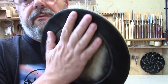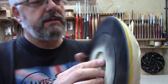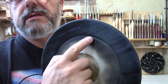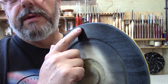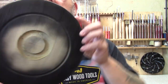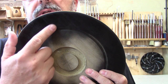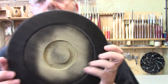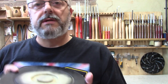Very often when you're painting you can get a bit carried away and get paint on the other side, so you might need to rework that side of the bowl. As you can see, this one is all covered up in masking tape. We sanded it down to 320, it's had a very light coat of sanding sealer and then it's been covered with ebonising black lacquer from Chestnut Products, which when we put the colours on will really help the colours stand out rather than putting it against the bare wood. Let's take it over to the lathe and start looking at some of the colours.